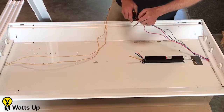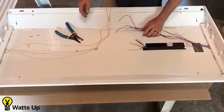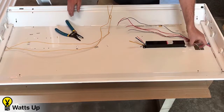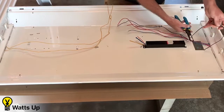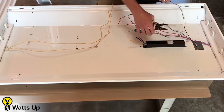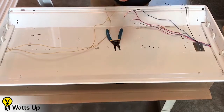These LED tubes have come a long way over time. The ones we're working with today are going to be line on one end and neutral on the other. We're going to take your black and white wire, commonly known as your line and common, remove that. Now disconnect the ballast all the way and remove it from the equation.